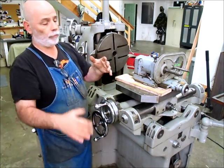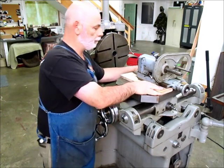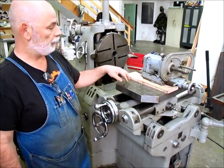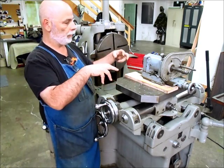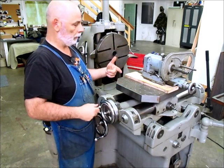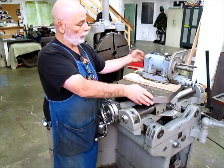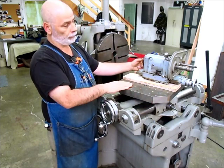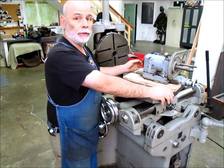With the R8 spindle removed I'd like to mount work on this side. Somebody made this nice heavy-duty plate here with half-13 tapped holes in it, so you can use it like a boring mill - mount your work with strap clamps, mill slots, bore holes, and do angular holes. The really interesting application might be boring holes that are precisely in-line with each other, like a transmission housing.